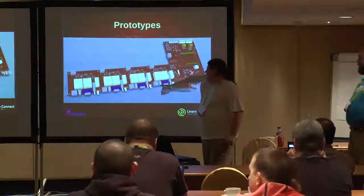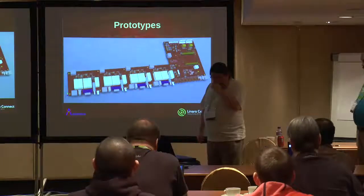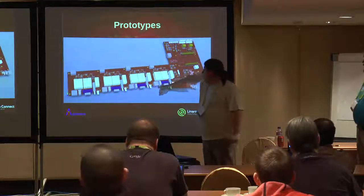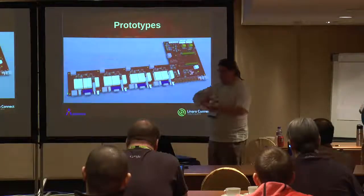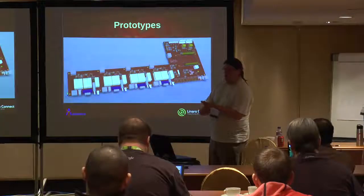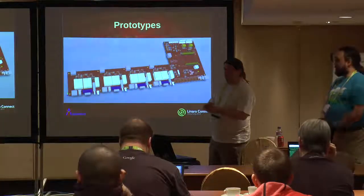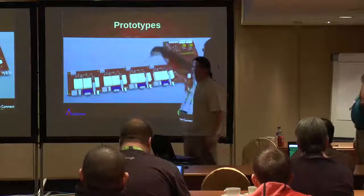Power, as we said, is via a USB output, and again we can use that as USB host back to the unit. And we have an Ethernet connection for the unit. So we've provided power out, we've provided a serial console, a USB console as well, it just happens to be there, and we've got Ethernet on the unit. We're not doing anything with the Ethernet, we're putting an Ethernet packet switch inside the box.